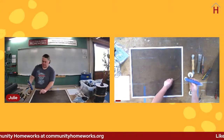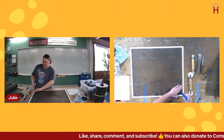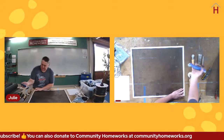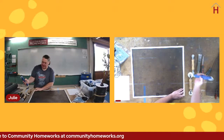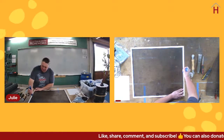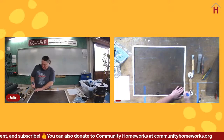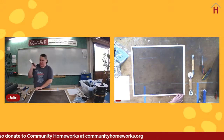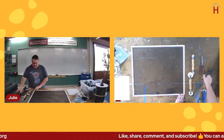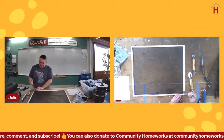Use your spline tool and roll the screen back into the channel, into the spline channel. And then using whichever side you're comfortable with, but typically the directions will tell you to use the end that has a divot. Use that, and just with moderate pressure, you can press the spline right back in. And then, as I said, a putty knife can be handy to tuck that in at the corner. If you end up with a little bit of extra material because that spline stretched, no problem. You can trim that off with your trusty utility knife.